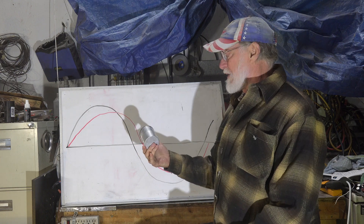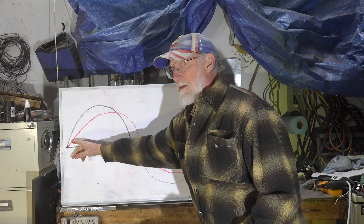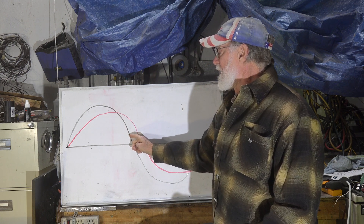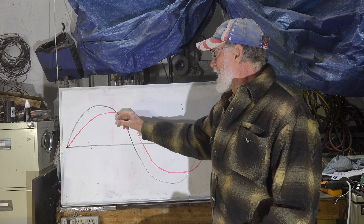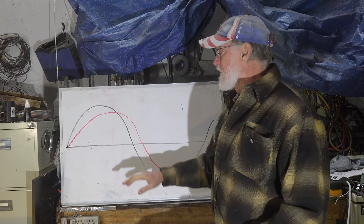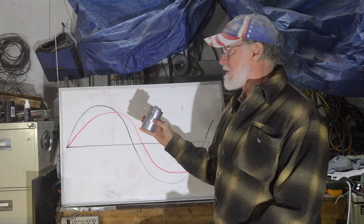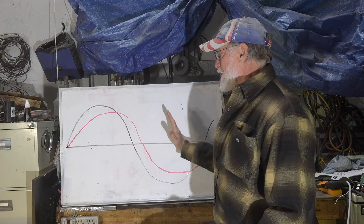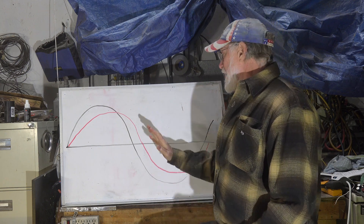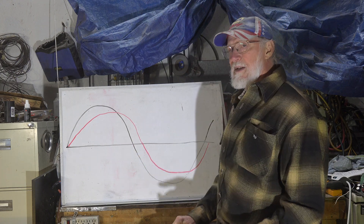And that's all it takes to get one of these to start. The power is going up, the capacitor is charging, charging, charging, then leveling off. As the main line goes down, the capacitor starts feeding power back into the circuit, and this starts dropping later. It also limits the amount of power that can go into the start winding — it is a power limiting device in many ways. But it's feeding back into that circuit and just moving the sine wave down a little bit. That's the simplest explanation for how the capacitor works — it just moves that sine wave over a little bit, gives a little bit of phase shift so the motor can start.